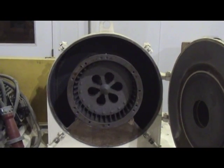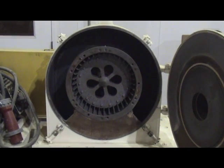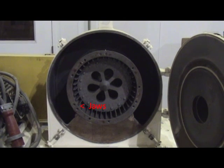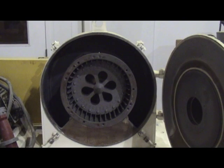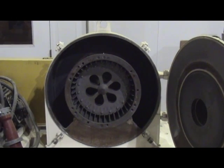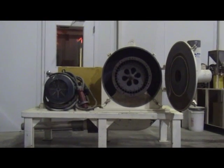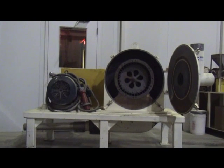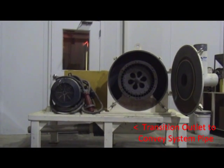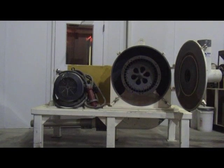The screen frame is held in close tolerance around this rotor, ensuring the particles are properly sized before exit. Serrated jaws mounted within the screen frame amplify the grinding action by creating rapid deceleration of the particles and shear as they are reaccelerated by the rotor blades. Once sized properly, air helps evacuate particles from the grinding chamber, where they are transferred to the convey system by means of a discharge transition mounted under the machine. In our next video, we will show you how a grinder works within a typical pneumatic conveying system.